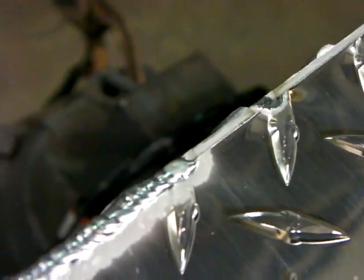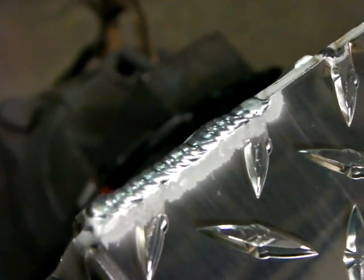This is run with the 80% helium — you don't have much cleaning action at all. And here's the 90 amps, 100% argon — a lot of cleaning action, even with the AC balance up towards 9 or 10.